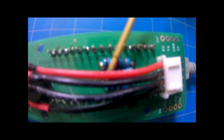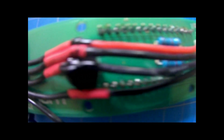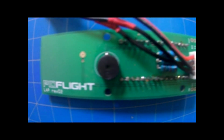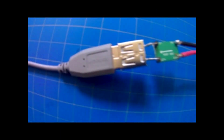We also have three resistors — these blue resistors. They're 1k, 1 kohm resistors, and this is just an adapter cable that I hooked up to the pins coming out of the PCB. The printed circuit board, the PCB, is a PIDFlight lap 2k which I ordered from Seeed Studio. Not necessary, but it just makes the build cleaner. To power this, I have a mini USB to USB cable attached to a step-down 5-volt regulator.